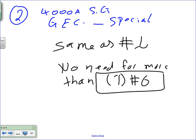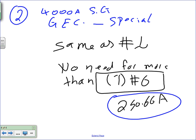So there is no need, basically, based on the article for this one, 250.66(A). Based on this, you are allowed to just tie a number six conductor. And it makes sense, guys. Can you imagine bringing a 500 kcm to a pipe or a rod? I don't know if you can have fittings that can fit a 500 kcm. I guess you can buy, but a pipe. So they just want to limit you, say, as long as number six is good enough.